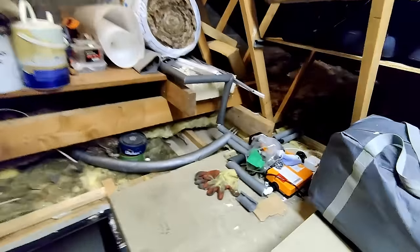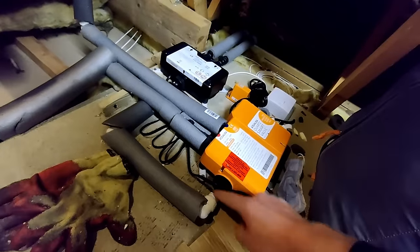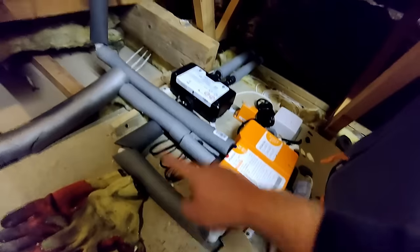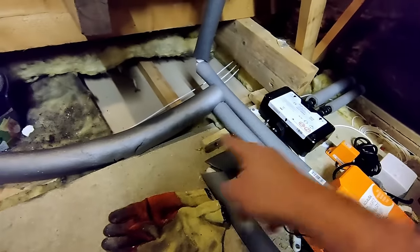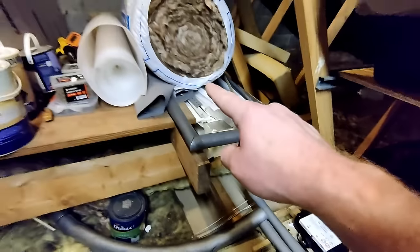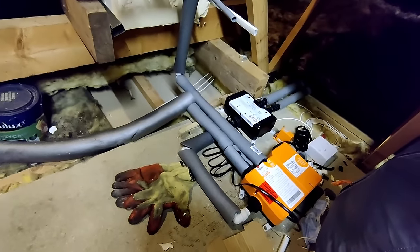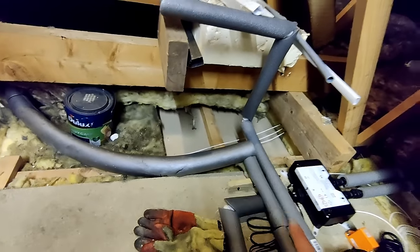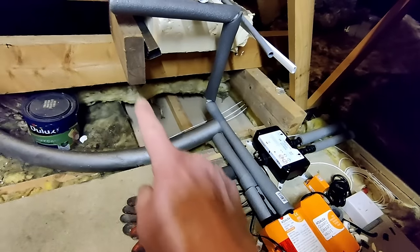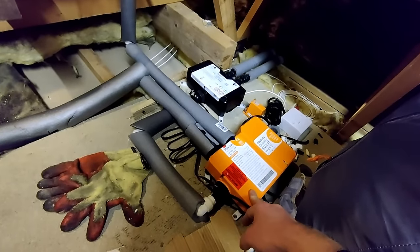I need to raise the shower pump - I don't like the way it's plumbed in anyway. It's got all of these right angle restrictions - unnecessary. So I'm going to rotate this 180 degrees so the outlet of the mixer goes straight into the diverter valve with no restrictor there. As you can see this then takes a right angle, but it's on 15mm plastic, and this one's all in 15mm copper but again we've got right angle, right angle, right angle, and down the other end there's two more right angles as well. I want to get away from all those 90-degree elbows and probably just run a straight shot underneath that joist - I guess 22mm from the 22mm feeds that come up into the loft, all the way over, and then just reduce them down to 15mm as they go into the mixer and into this smart valve.